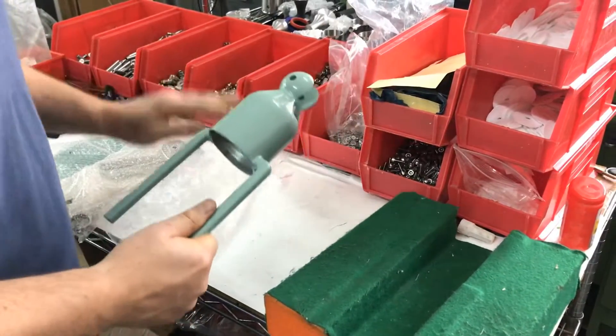To be honest, you should never use the ball end of an Allen key if it's really tight or you want to tighten something up — always use the straight end, because the ball end is pretty delicate and will probably strip. So I'll add a dab of Loctite — just a little tiny bit to lock these screws in place. This is meant to be a permanent lock type, but because I haven't used an activator and cleaned out the threads, you can still adjust it a day or two later.